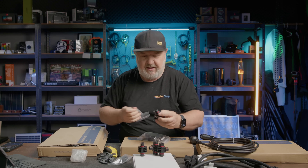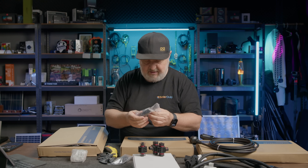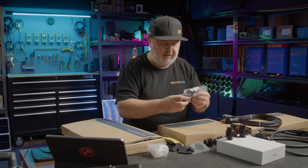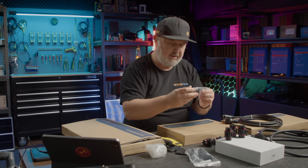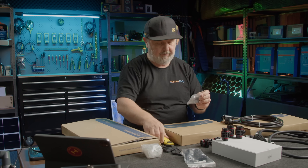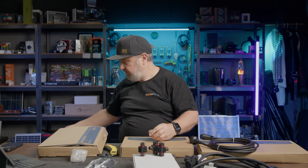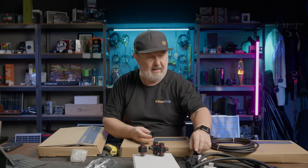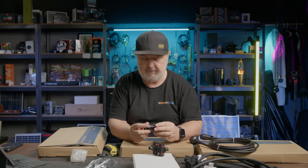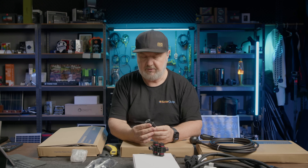I think what I'm missing is the micro-inverter because of the type of connectors we have here. We've got some pins — that's a pin connector. And this looks like an end cap. Because at the end of your trunking cable where you've got no more inverters to plug in, you'll need to blank off the connector at the end. There's your blanking terminal at the end.